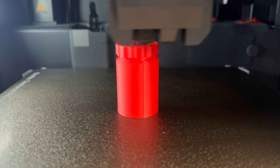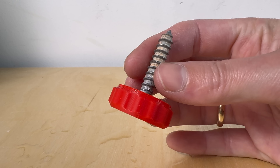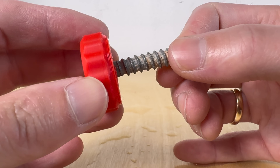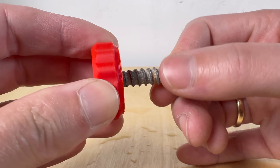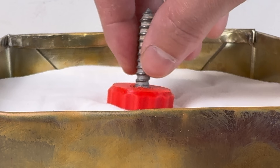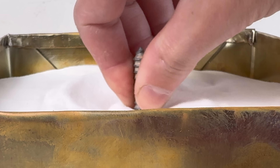Let's take it one step further. Because we had to add extra clearance and tolerances to allow the part to easily fit into the 3D printed part, the encapsulated object is a little bit loose. To fix this, we could use salt annealing to basically fuse the plastic to the metal object.